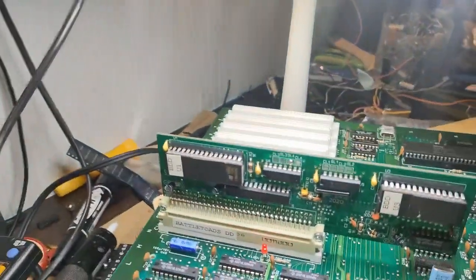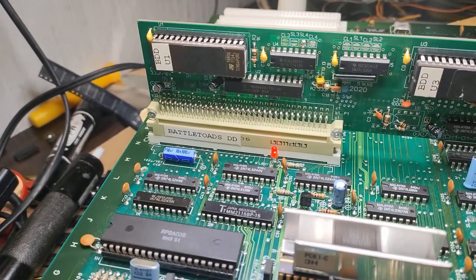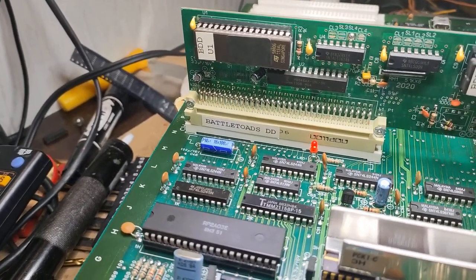But one thing I noticed is when I hit the enter button, it is static garbage on screen. It looks like it keeps repeating, and it looks like my sync signal is all messed up. But you can see that's all just static garbage there. It's not reading anything. And I was looking around on the board itself, and these Fujitsu RAM chips are actually quite strong. The Fujitsu TTLs are really horrible, but the RAM chips are quite strong.